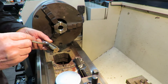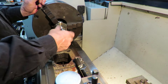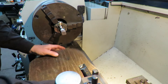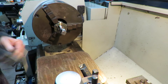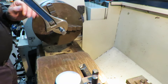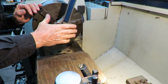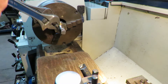I saw the other day somebody put up a photo of somebody who tried to power feed a tap like this with a spanner — that spanner came off and went right through his eye. It's not pretty and he has probably destroyed his life. I put carpet down on the bed just to make sure that if the hand slips I'm not going to damage the ways. I'll just screw that in a bit first by hand — remember this is tapered. The method I use is two spanners: the second one goes on here holding the chuck, and that's the way I'll do the hand threading.